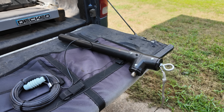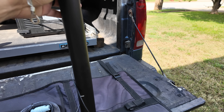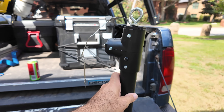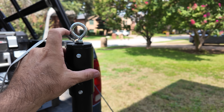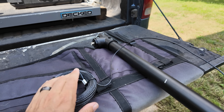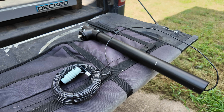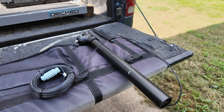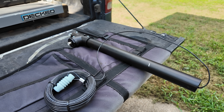I also picked up this brand new 160 meter antenna by Cable - I'll put the link in the description. What you do is hang this from a pole or mast; he says put it 50 feet in the air if you can, though anything over 30 is fine. You run it down as a sloper to the ground, about 65-66 feet - same length as a 40 meter end-fed half wave. This will do 160 meters, so I'm very much looking forward to trying FT8 on 160 meters.